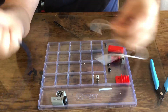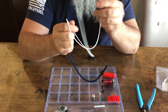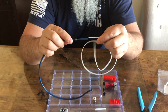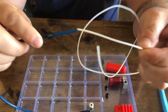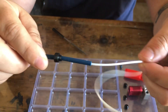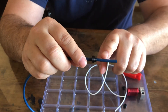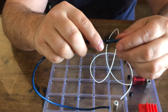Let's use an end without a giant burr. If you watch, that just goes straight in and doesn't catch, because this PTFE tubing is perfectly aligned with the other one — when I modeled it, these are on the same axis.